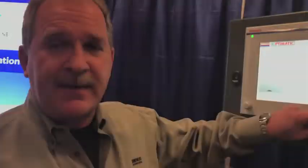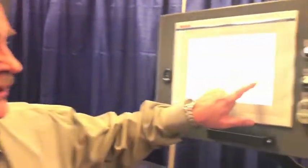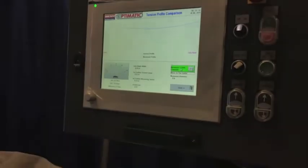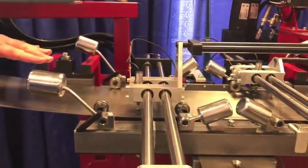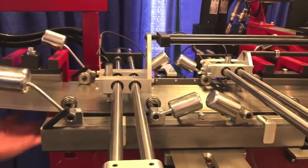What we've got here is actually the mapping function. When I press this green button, the machine is automatically moving across the blade — you can see that over here — and it's measuring the condition of it. We have a zero set with carbide rails underneath the blade, so the machine knows where zero is, and it's measuring the condition of that blade relative to zero, comparing it to what it has stored for a measurement that it wants to have once the blade is properly reconditioned and ready to run again.